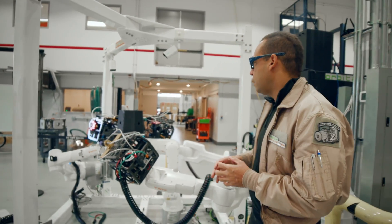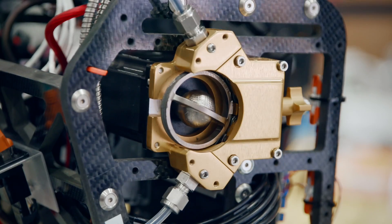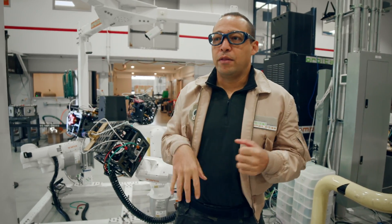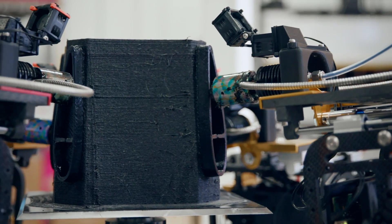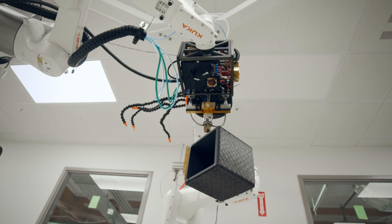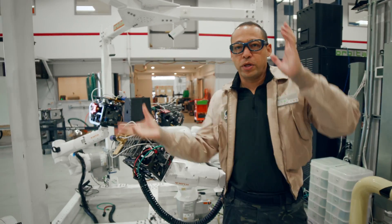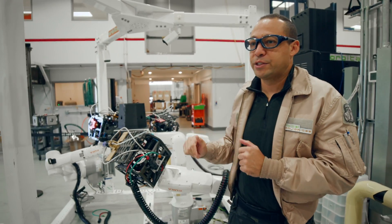We ended up needing to think much more deeply about the manufacturing process and how that's tied in with what the drone is. We came to the notion of coaxial extrusion — that's where you've got one nozzle inside of another nozzle. The internal nozzle puts out the continuous wire, continuous fiber. The external nozzle insulates the wires and glues the fibers together. If we print with plastic, we get the shapes we want; with carbon fiber, we get the strength we need; and with copper wires, we can run all the motor wires, traces, and antennas.